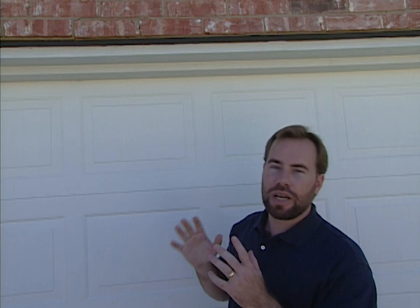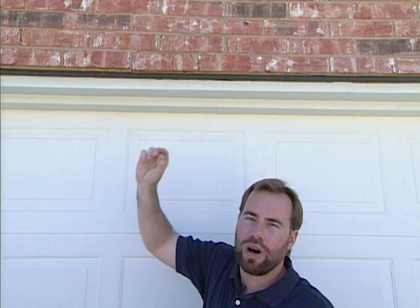Here's our first point to catch. We've got a crack right above the garage door, but it's not a major crack — it's pretty minor, really just cosmetic. If you look at it closely, you can see it's not too wide. If it got to be a half inch or more, we know we might have a structural problem.